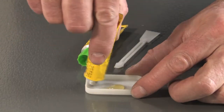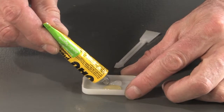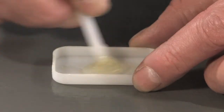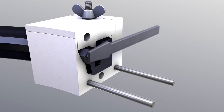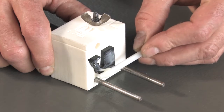The adhesive involved is a two-component type. The two components must be mixed thoroughly in a ratio of 1:1, as specified in the instructions attached. Processing temperature not less than 15 degrees Celsius. Prepare a new mixture for each bonding routine. The viscous adhesive shall be distributed over both cut surfaces in such a way that it adheres well and does not drip.